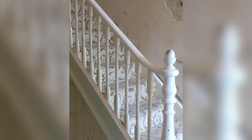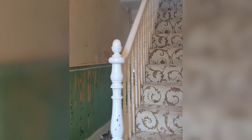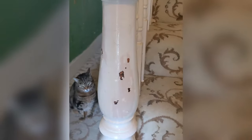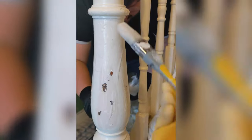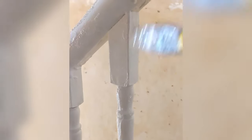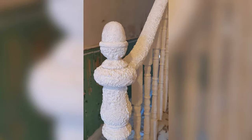How to remove years of gloss paint from woodwork — we did a lot of this on our Victorian staircase, bringing this original feature back to life. There were a lot of layers to get through, so we started with this paint stripper, Wickes' own brand. You just slop it on nice and thick and leave it for about an hour. It gets to work pretty fast — you can see this bobbling effect where it's peeling off that top layer.